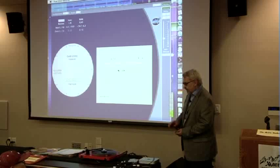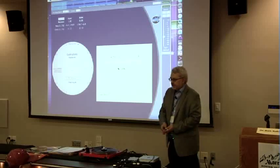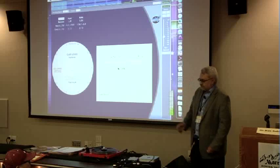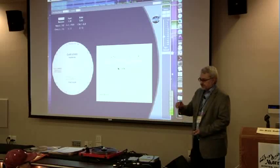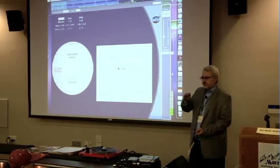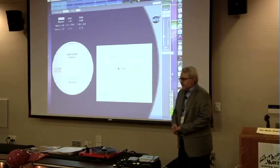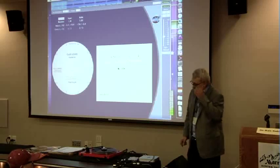And we also make adapters. If you have a VPI turntable that has a connection block on the back where you can remove the interconnect, we also make balanced shielded twisted pair for lower noise that go directly from the turntable all the way to this input device. And those, with a discount, are $59 a pair. We use high quality Canare Star Quad, which is another iteration above shielded twisted pair. It gives you even better common mode noise rejection. So that's what we use in the adapters.